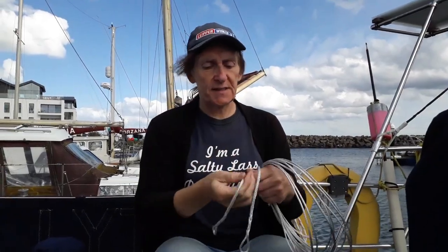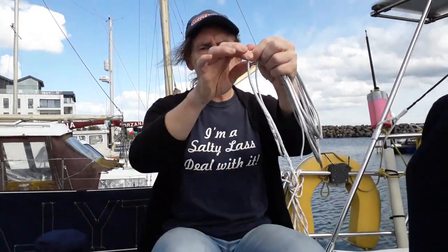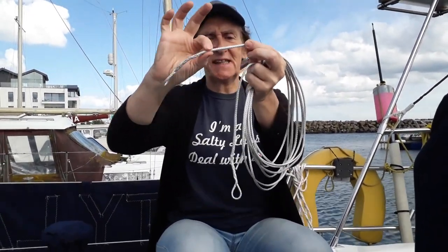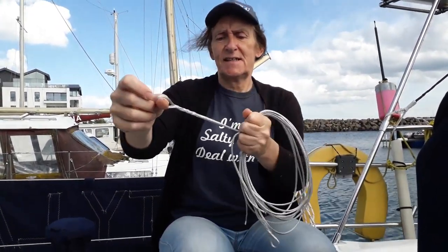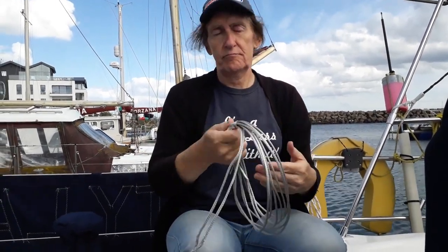I've already done my first set of two and they're already all spliced up. As you can see, the knot, like all good Dyneema splices, is on the inside. It's just a case of putting them on now. The thing about this is it has to be done from the top down. You start at the top and you work your way down, because each of these has to pass through the ones above it and then be secured at the bottom. I can't secure them from the bottom up — I've got to secure them from the top down.